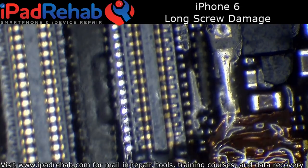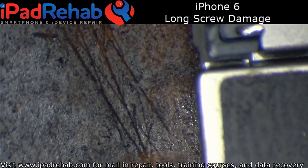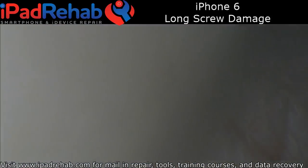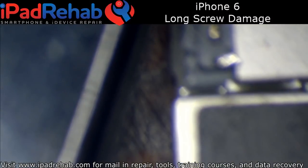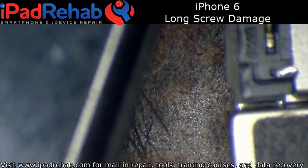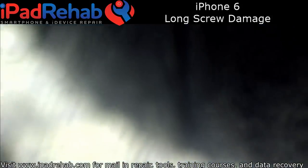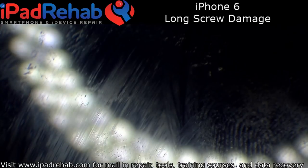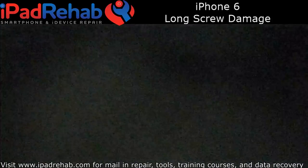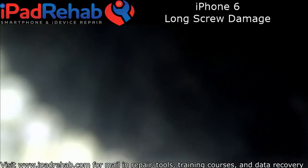Let's see what happens when I boot you up. All I'm looking for right now is just that I get an Apple logo, because if I can get an Apple logo then the battle is won. Then I can reassemble and fully test for flash, Wi-Fi, and all that good stuff. But right now all I care about is: can I get an Apple logo? I don't know if you guys can see that, but there is a very, very faint Apple logo there. So it is now displaying an image, but I have no backlight.